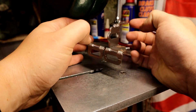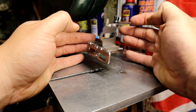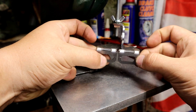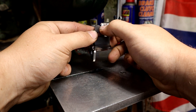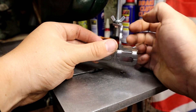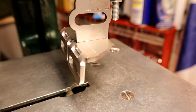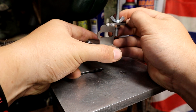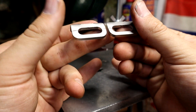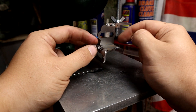We're now on mark five and this is a rough fit-up. I don't get a lot of time in my shed, so this is kind of a rough start. The reliefs have been much nicer and we've got a much more 90-degree profile on the sides. We've had no splitting, which is great. We've added an additional slot in the top to try and fold that — the big difference between top and bottom is we increased the slot, so this is now quite suitable for a lot of applications. The whole design slots together and then we're going to weld a bead down either side, square these off, and fit our ball bearing guides from each side.